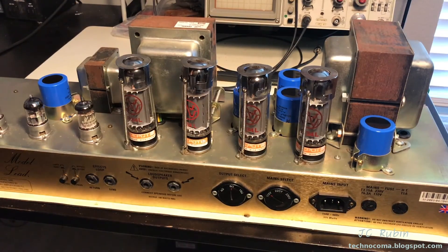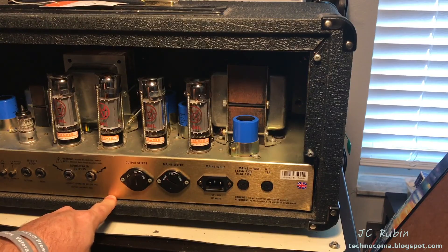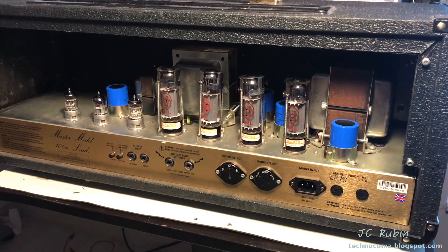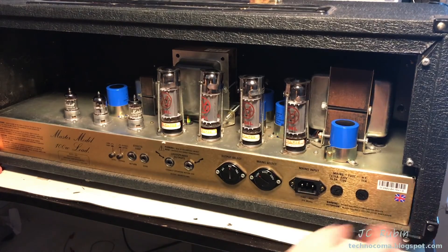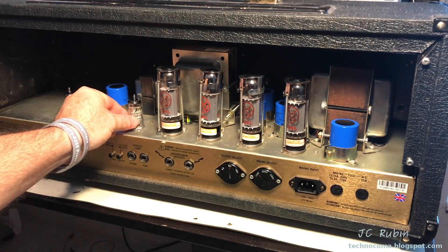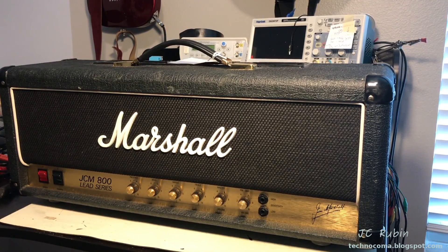We'll take one more quick look at this amplifier after the work has been done - caps have been replaced, couple tubes have been replaced, and everything has been cleaned up. We'll put it back in the chassis now. It's important that you walk this one in carefully because the metal retainers will get caught on the metal piece that lines the bottom of the cabinet. This is one of the more difficult ones to reassemble - it's really heavy, and with the clips everything has to be just right. If you knock a clip through you've got to take the whole thing back out. I'll put the shields back on these tubes, then the cover back on here. All buttoned up and finished. I hope you enjoyed this video on the maintenance and repair of this JCM 800 Lead Series Marshall amplifier. Thanks for watching.